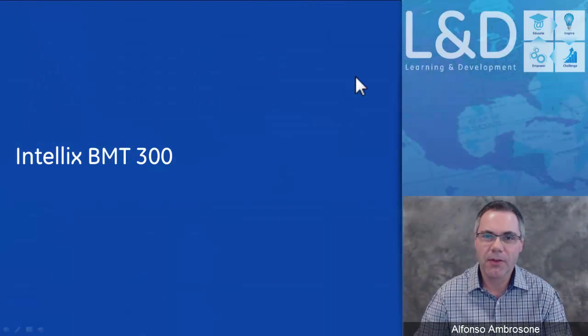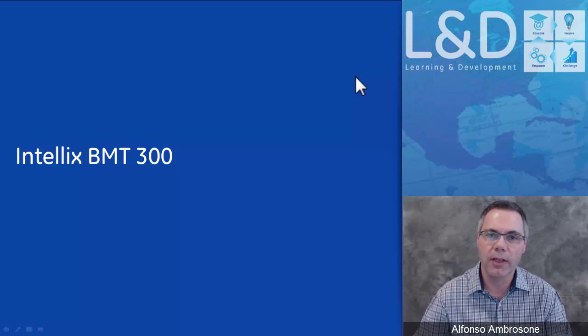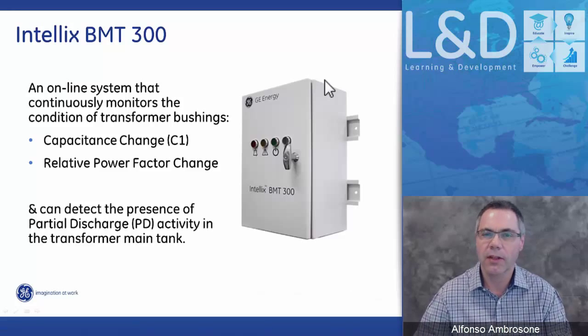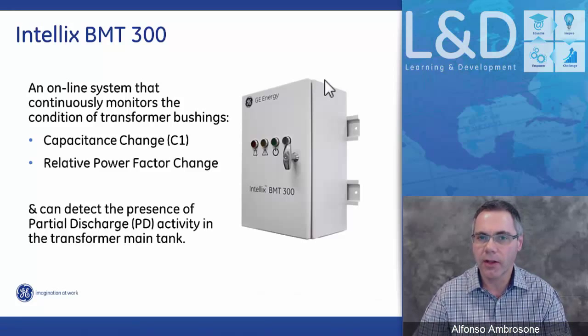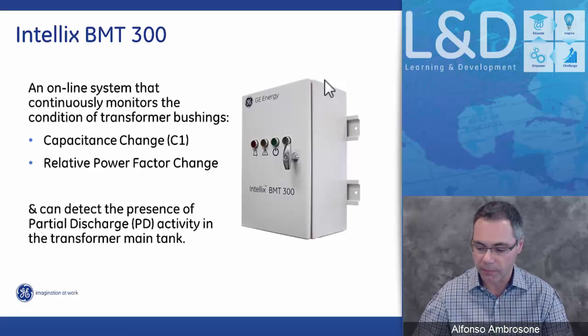I'm Alfonso Ambrazon, and in today's session on monitoring and diagnostics, we're going to take a close look at the Intellix BMT-300. So what is an Intellix BMT-300? It's an online system that continuously monitors the condition of bushings. We look at the capacitance and power factor of each individual bushing, with the additional functionality of being able to monitor any partial discharge in the main tank.